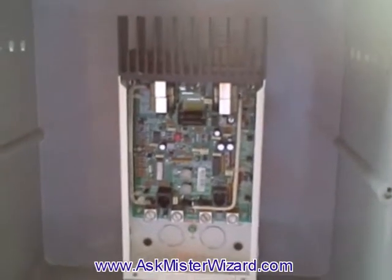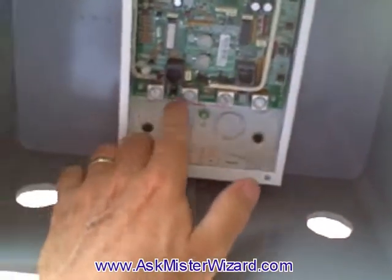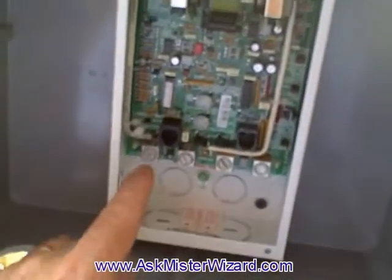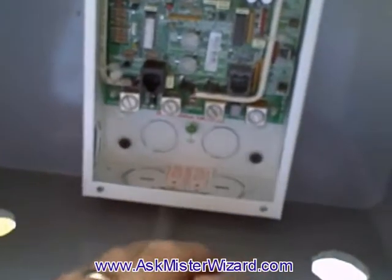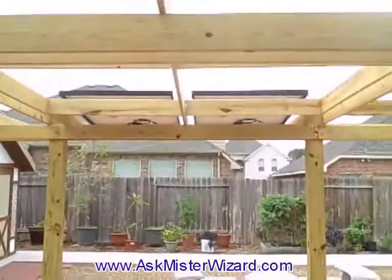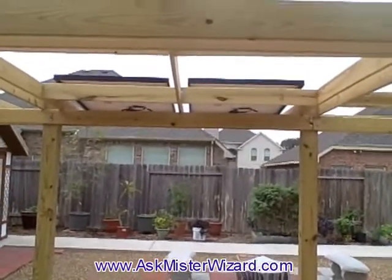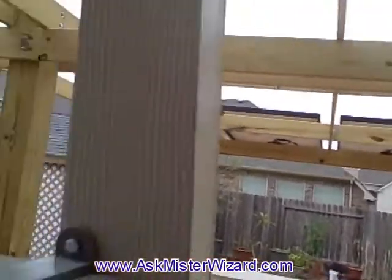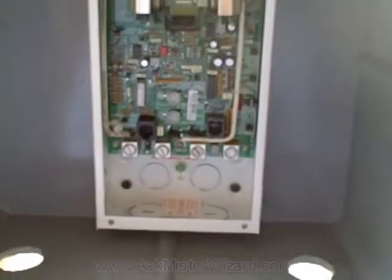This requires a lot of attention to safety. The battery has a lot of energy in it, and any time I'm wiring a storage battery I have to be aware that it can deliver a tremendous amount of current. I want to be careful that it doesn't short out across my ring, because that would fry my finger, and I don't wear a metal watch band for the same reason. Secondly, the photovoltaic cells are delivering energy whenever there's sunshine hitting them, so the final connection will not be made until dark. I'm going to wait until it's dark to wire the series-connected photovoltaic cells to the charge controller. I don't want anybody to get fried in this operation.